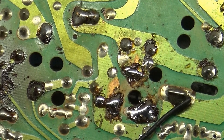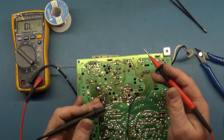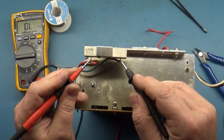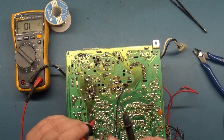So let's make sure we have good readings now. Okay, we'll start with the voltage regulator, pin 3 and 4. We're hoping for about 0.155, 0.15 something. There you go, look at that, 0.15. And I'll bet you our resistor now reads our proper 180. Yep, so we definitely had a bad voltage regulator. Not shorted, but still bad. And go back to diode mode, HOT.